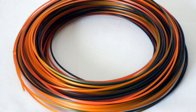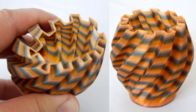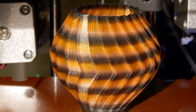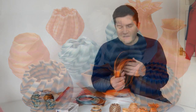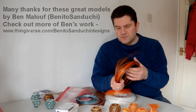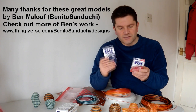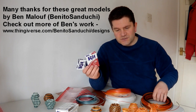These are particularly nice models to print with this as well. You can see they're stretchy — that's the other thing with nylon, it's a flexible material, so it's quite forgiving. It bonds very well; the layers are really strongly bonded together so you don't have any delamination problems like you do with some other materials. Nylon is really nice and very versatile — you can get some lovely effects with dyeing. I've just got some more dyes today: royal blue and scarlet to try, so I'm going to try some deeper colour dyes, which will give me some really interesting prints.